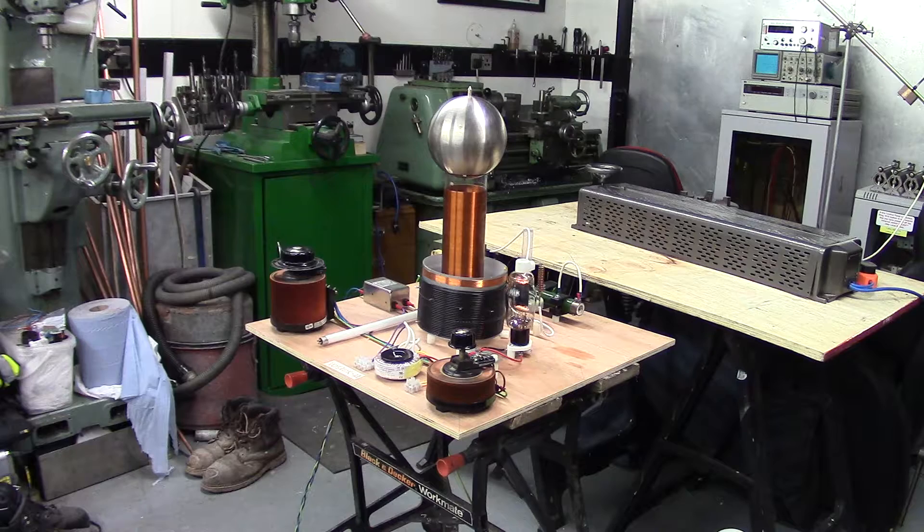I had quite a few issues with it today because the actual vacuum tube has been a bit of a pain — it had a defect. The pins at the bottom of the vacuum tube go into a glass sleeve before they go inside the vacuum tube, and that glass sleeve — the pins in there actually come too close together so I get actual arcing between those pins.